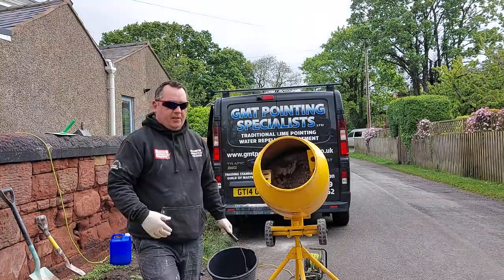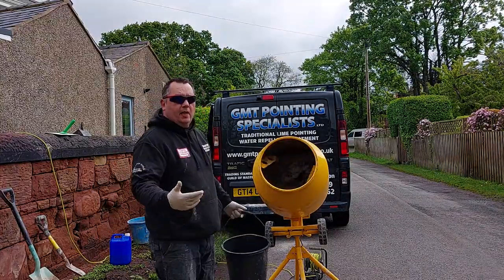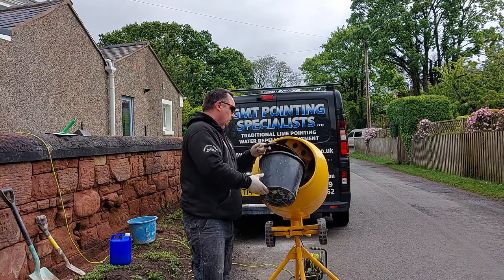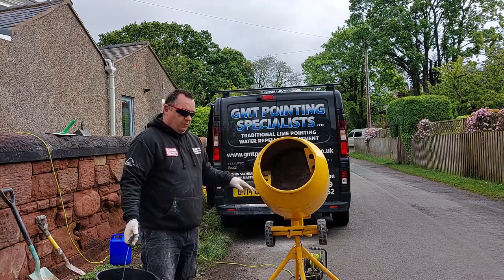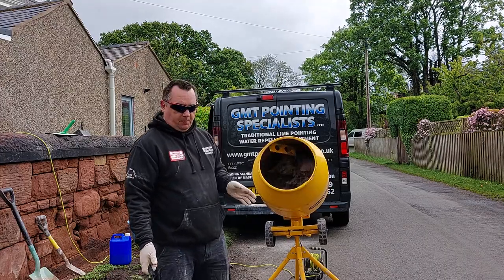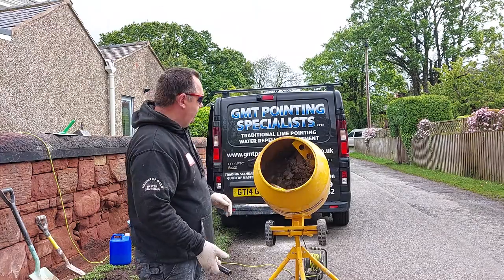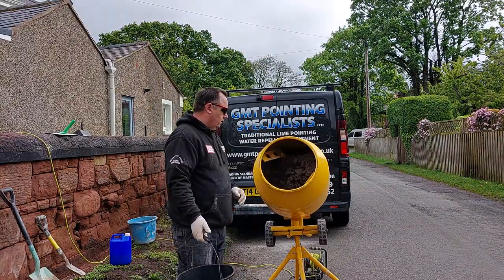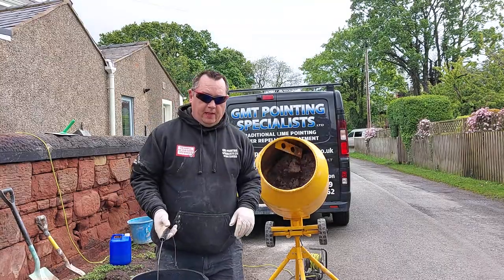Out of experience, I know how much water to add. I'm actually going to add too much water. Whatever you do, don't stand in front of the mixer, because if that splatters, it's going to splatter lime, and lime burns. This is an NHL 3.5.